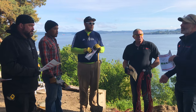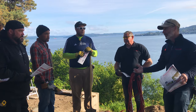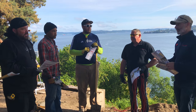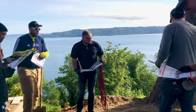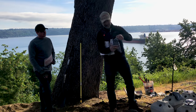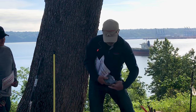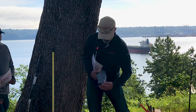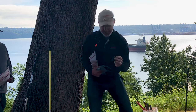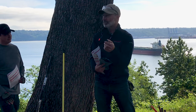The key is, as you get a bigger jackhammer, you don't just set the weight on the pin. We prop the pin up and hold it so it's in the center of the hole, or it can try to bang a neck. If you look over here, there's a bag on top of each one. In that bag you're going to have what we call inspection plugs and caps. This cap will go on the pipe when it's completed. This plug keeps the dirt out for the inspector — it's not necessary for the strength of the structure, it's just for the inspector so you can put the tape right down there.